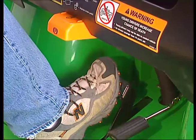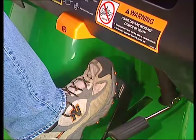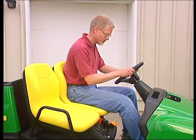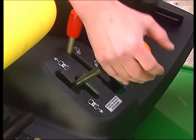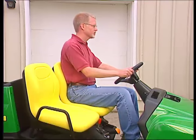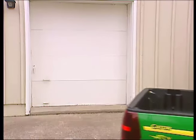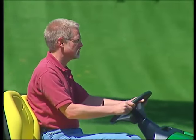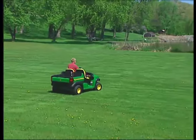Fully depress the brake pedal to release the parking brake. To shift gears, you must first let the engine slow completely to low idle. Use a firm shifting motion instead of trying to ease the lever into gear — this will help align the gears and prevent grinding. Drive slowly at first to get the feel of it. Remember, safety comes first.